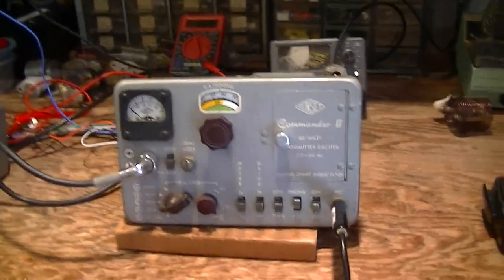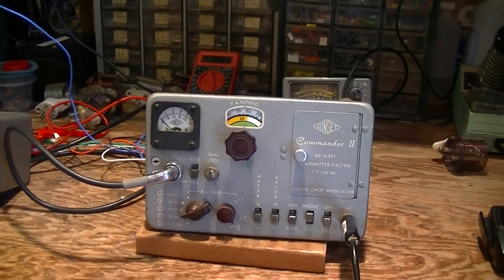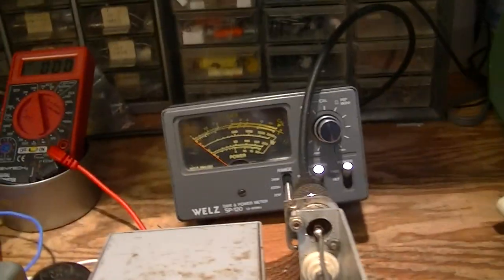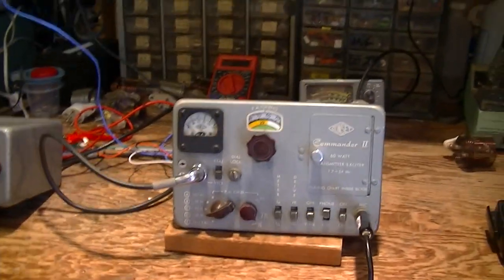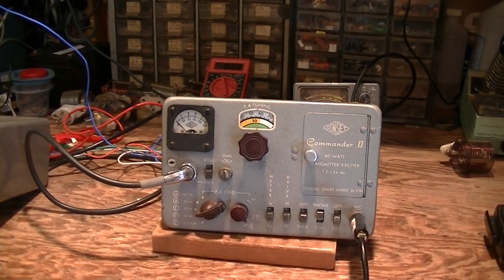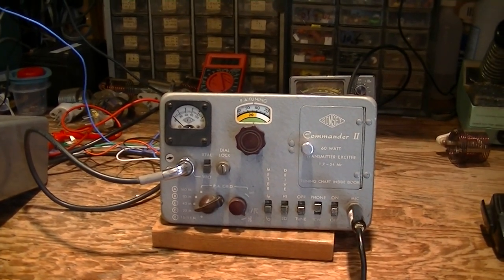It's still got the original filter capacitors — there's one three-section electrolytic in there, which is a cathode bypass cap for the modulator and a couple other things — so it's got a little hum. Plus we're using clip leads for all the filaments. Interesting little transmitter. I'm running just 300 volts on the plates, but as you crank that up every 10 or 15 volts gives you another watt of output. If I switch it around to run 400 volts on the final, we'll probably see an output around 15 or 20 watts. The thing wants to run 28–30 watts input and probably about half of that for output, with tons of audio.